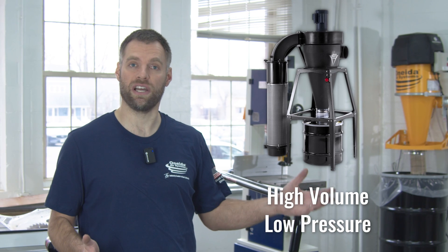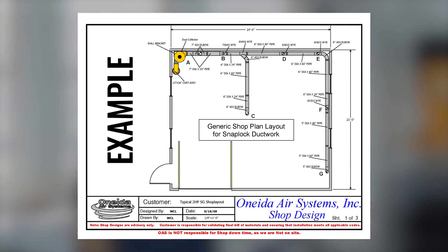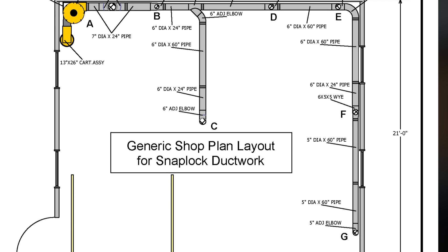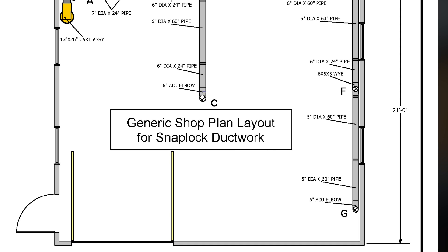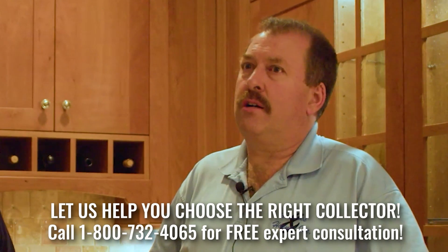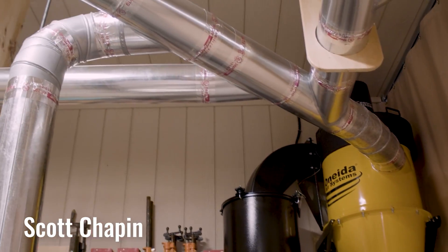With a traditional dust collector like our V system or some of our larger dust collectors, you have to duct it to all your tools. With steel ducting you need to design that ducting appropriately to take gentle bends and reduce at the right times, because a traditional dust collector is a low-pressure system and you can hurt your performance to those tools very quickly if you don't set it up appropriately. At Oneida Air Systems, for those who buy an Oneida Air dust collector, we offer a duct design service to help design their duct work and optimize the setup in your shop.